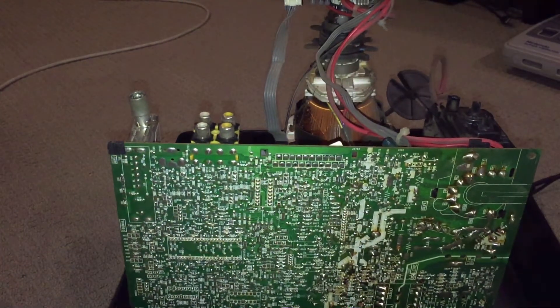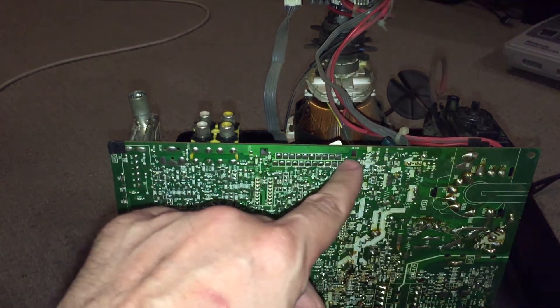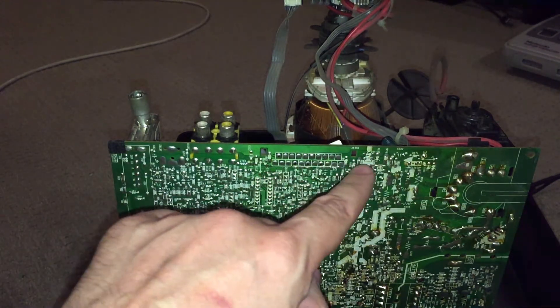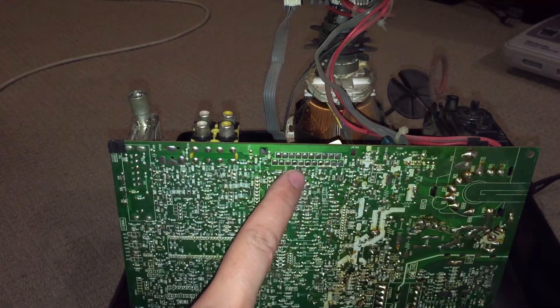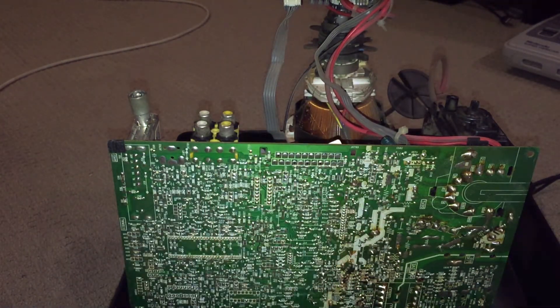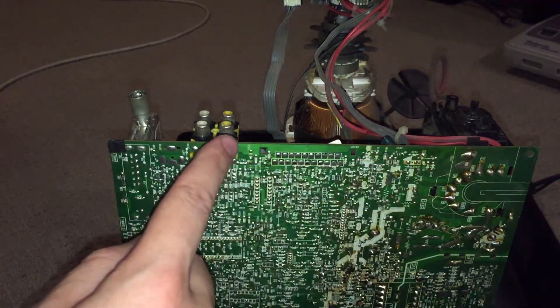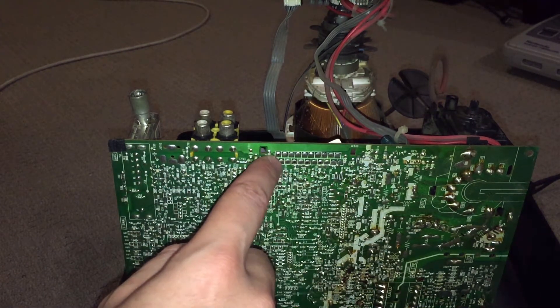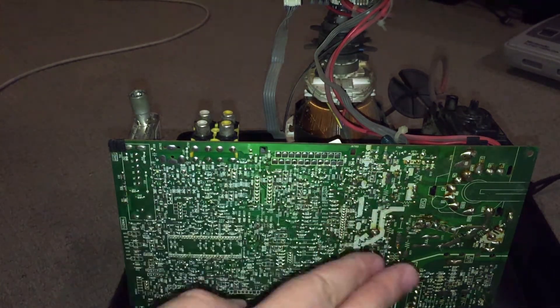A couple of things I noticed: you can see here at the back there's actually a pin — there are some soldering points for a SCART connector that is not wired up. Unfortunately, I traced the RGB pins, the ones with the black mark here, and they go absolutely nowhere. So I'm positive that this SCART connector is actually only for composite. This pin here, which is actually connected, and the blanking pin — that's pretty much anything that's connected on that whole thing.